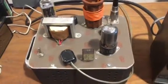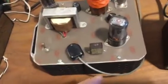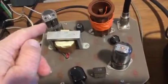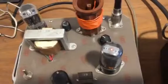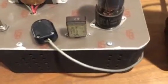So what we've got with this transmitter: we've got the power transformer right here, a 6AX4 rectifier tube over here, of course our crystal is right here, the 6V6 from my grandpa, and the output pi-net coil, and then of course the antenna and the crystal is right here as well.